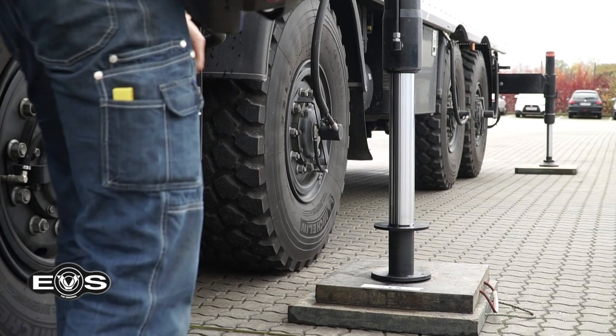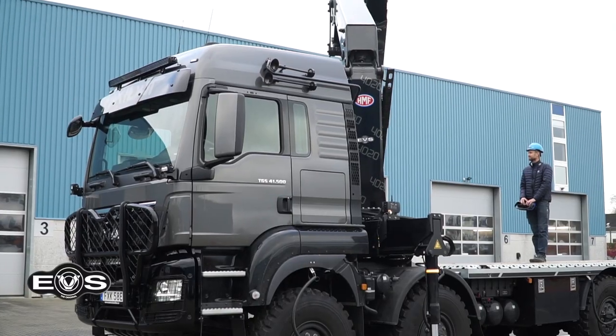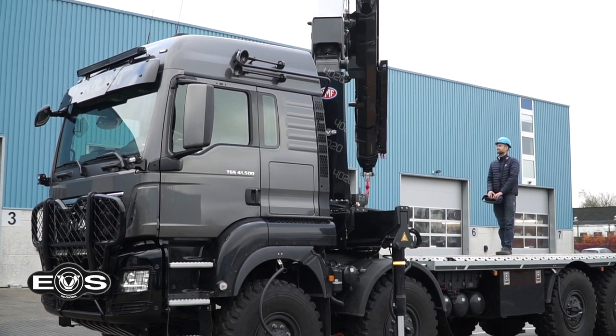But how are we able to use the advantage of the EVS system in a real situation? Imagine you are downtown and you have to deliver something with your vehicle. It is not possible for you to get the legs further out than 60 centimeters — what we used in the beginning — and now you have the same weight. How far can you get, or what should you do to get further than the 8.75 meters? We have to stabilize the vehicle by using physics.